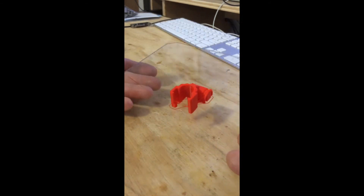What I like about it is it stays fairly true, like glass does, but it weighs a lot less than glass. Well, this is a pretty thick sheet. I tried a thinner sheet at first, hoping I could save weight, but it's a little too flexible. The problem with that was it wouldn't stay flat — you clamp it down and its own weight would make it sag in the middle if there were any bubbles, or it just doesn't support its own weight and stay flat well.